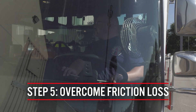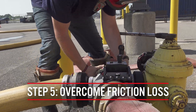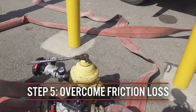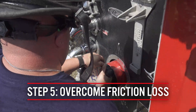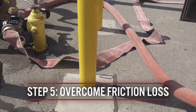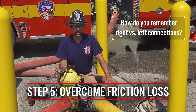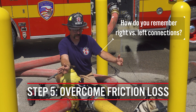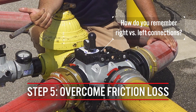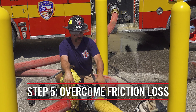You'll see in the video the Crown Point engine positioning appropriately, engaging their pump, and making the appropriate connections to the four-way valve and to their pumper. A helpful mnemonic for remembering where to connect: standing behind the hydrant as taught in basic firefighting classes, the right-side connection goes to the pump intake — because 'I don't like being left out, so I go right into the pump.' The left-side connection goes from the large diameter discharge back to the valve to boost the pressure.